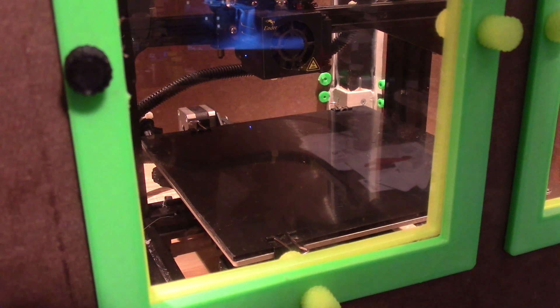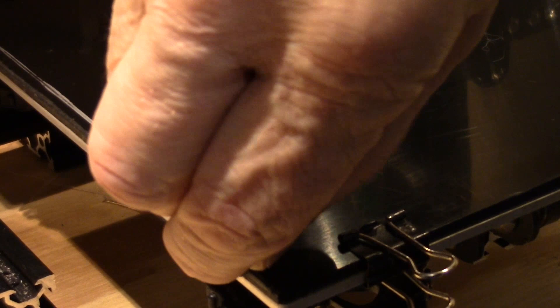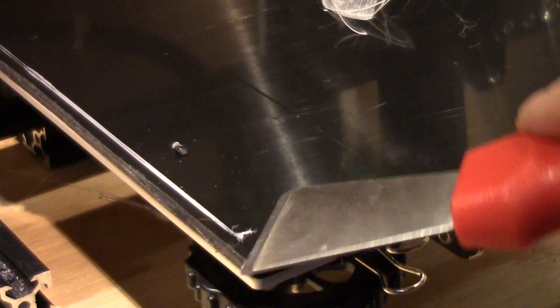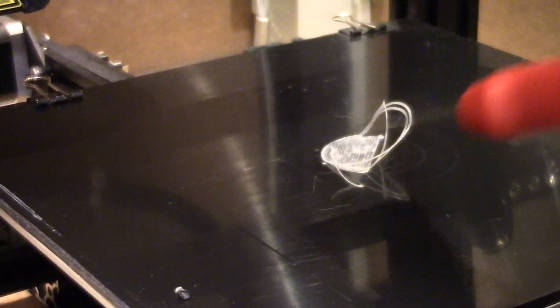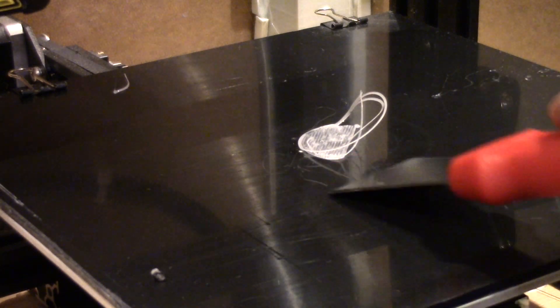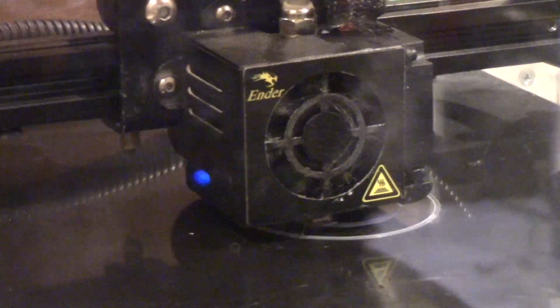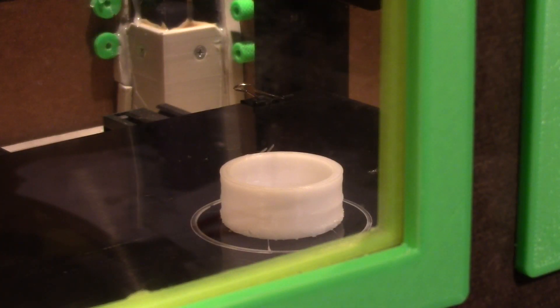Link in the cards above, of course. And here we go. I am printing at 220 with a bed temperature of 80. I just want to say some of that seemed to stick pretty well. There's my little purge line that gets drawn and that seems right — it's really down. That seems pretty well stuck down, too.